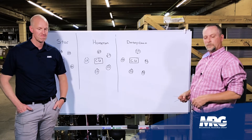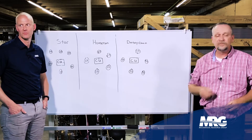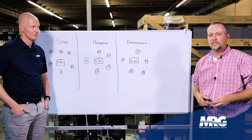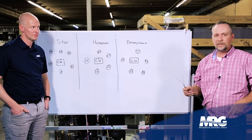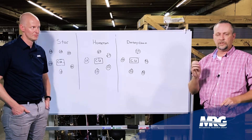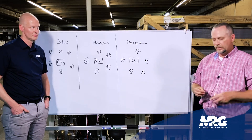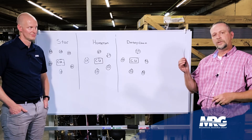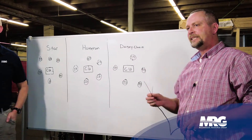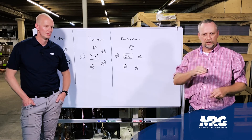So I'm going to start off first with the type of wire to use. Very basic, simple wire. When we're talking Daikin VRV commercial stuff, a lot of the other stuff out there may be five or six conductors, special wire — nothing special about this wire. A two-conductor twisted pair copper, no shield, no ground. Very important: no shield, no ground. That'll cause a lot of interference within the comm loop. Daikin VRV units use what they call D3Net — that's their communication loop. It runs a 16-volt DC signal through this comm wire.